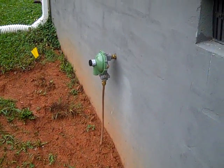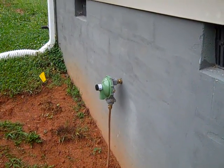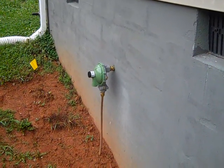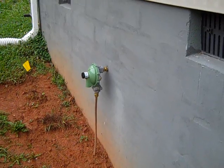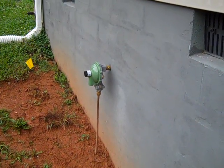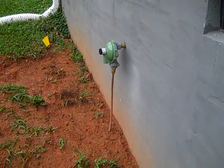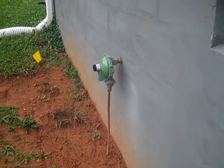You have to stub up with copper hard pipe, and then inside you go to your various appliances. In this location we're just going to a gas range and a gas dryer, but you could go to your refrigerator, your lights, a lot of other things. We're also going to put a propane generator on the system.